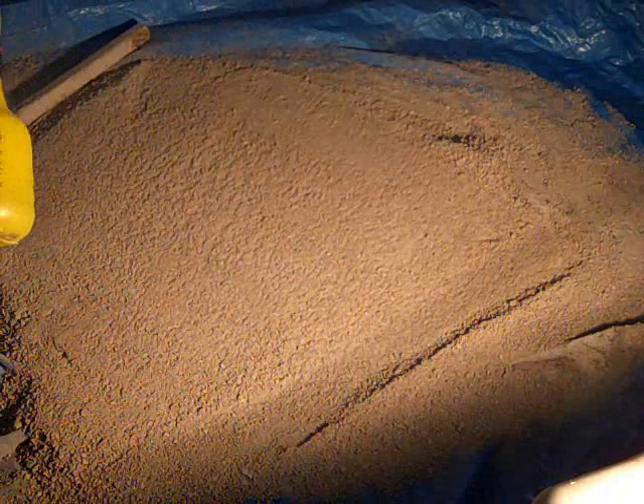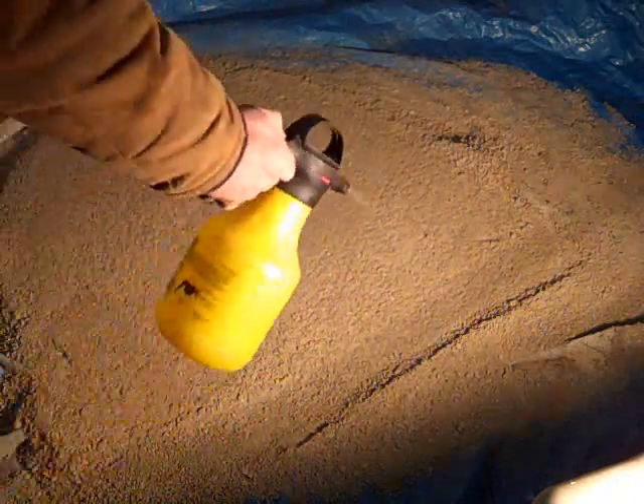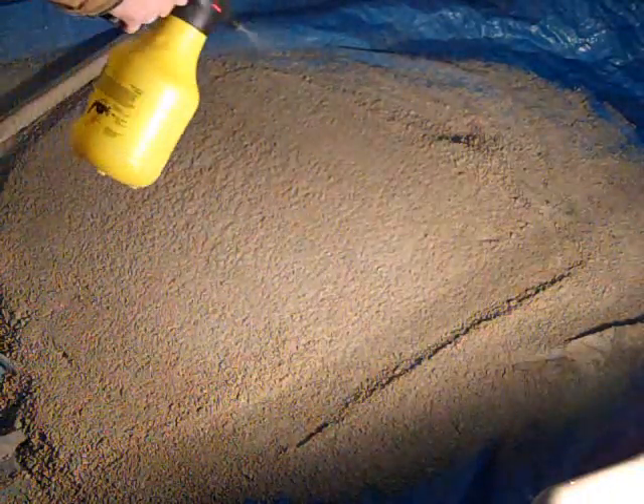This is a half batch — 50 pounds of sand with six pounds of bentonite, so it should be half a gallon of water. I think it's going to be about right with half a gallon, maybe a little more. You can just go little by little and keep checking the consistency until it's what you want. There's no more dust coming off of it like there was when I first started, so it's all got some moisture in it now.